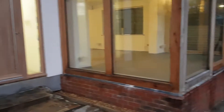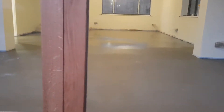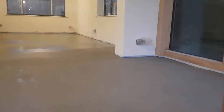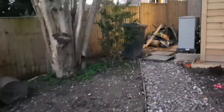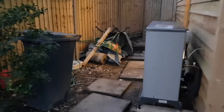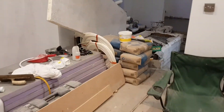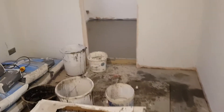If I spin around, you can see we have a floor. Now it's drying, which is why you can see there's some wet patches and some not. But look at that level - we finally have a proper finished floor level ready for tiles. So if we head on into the house, you can see what we've been up to. This has been a four-person job with Ali mixing, my mum fetching all the correct ratios of water, tearing bags and counting bags, me putting the powder into the buckets and then lifting and pouring, and Dad using the spiky roller to spread.